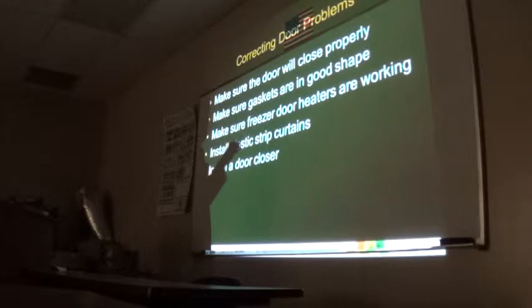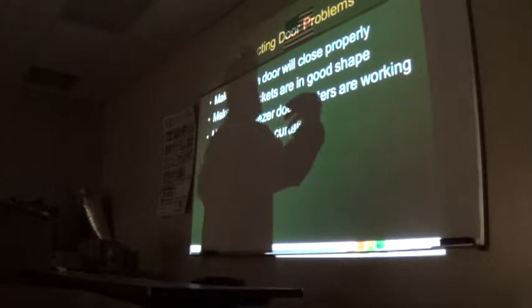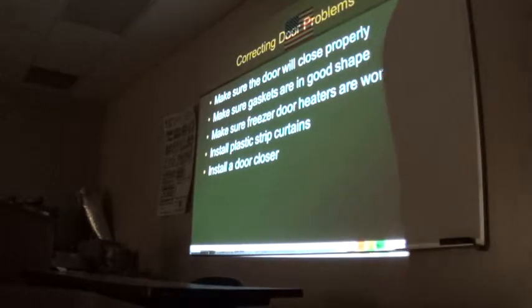Yeah. No, they're pretty easy to change because they're snapped in. You just pull out and you get the exact size and you lay it in and there's a groove in the door. Oh, okay. And you just snap it in. But one thing is, we normally use a little rubber mallet and tap it around the door and it just snaps right in. It takes all of 10 minutes to remove one and clean up.